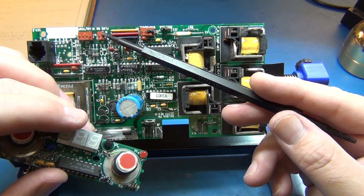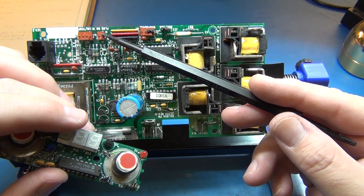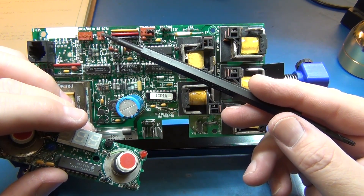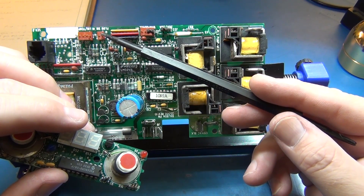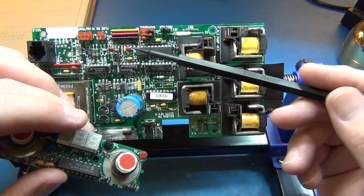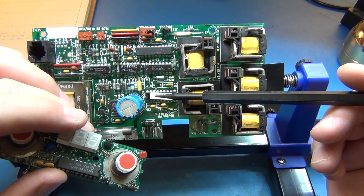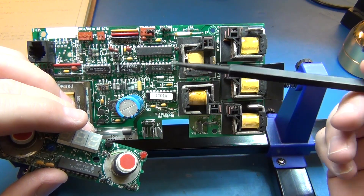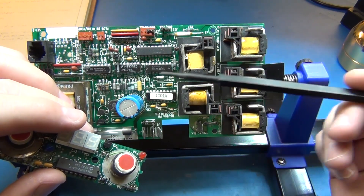The other proof is: is there flow? There's like a flapper valve in that same water feed pipe that opens and closes and changes a potentiometer. If that isn't reading a certain low ohms, this controller knows the water is not flowing in the feed pipe and will also turn off the heater.